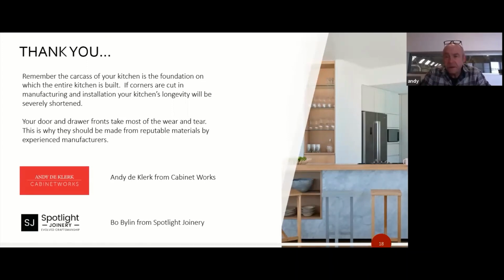I have never found a completely waterproof product for the components that we need, carcasses, doors, and things like that. But I think with careful and clever design and using whatever waterproof, or rather water-resistant, products they are, you can go a long way towards mitigating damage, which water does create a lot of. The other thing, obviously, is you could use teak or Iroko, which are water-resistant timbers, with everything else that entails for solid wood carcassing and so on, as that's been discussed.